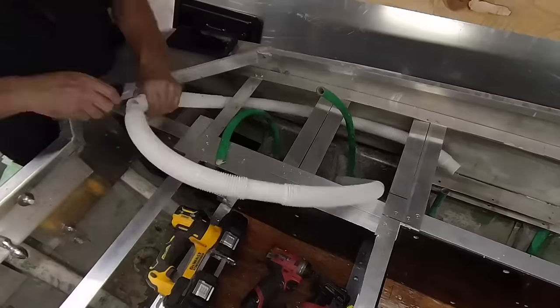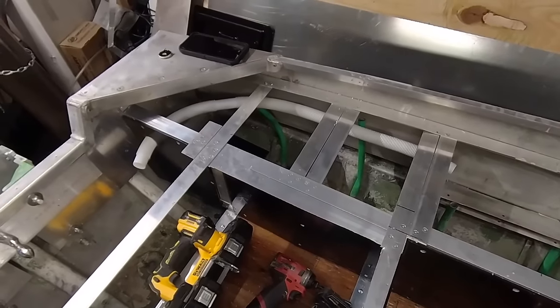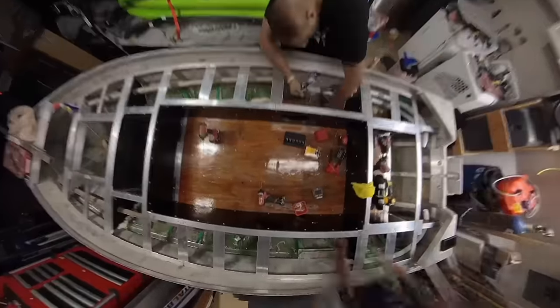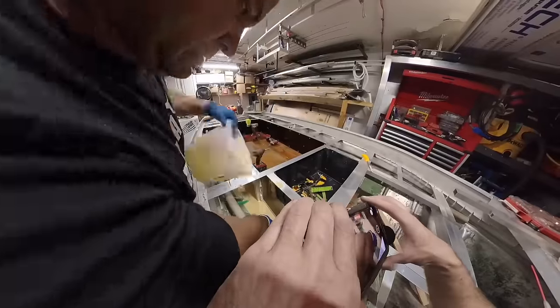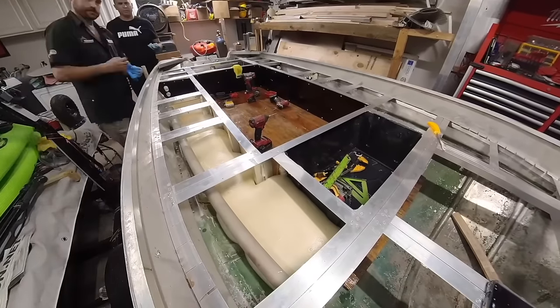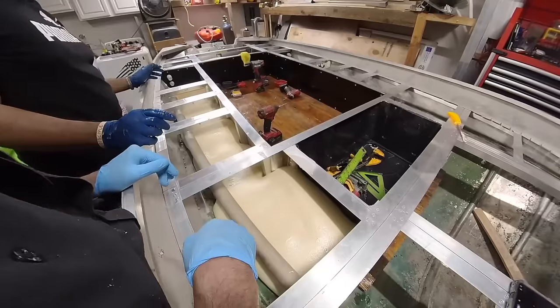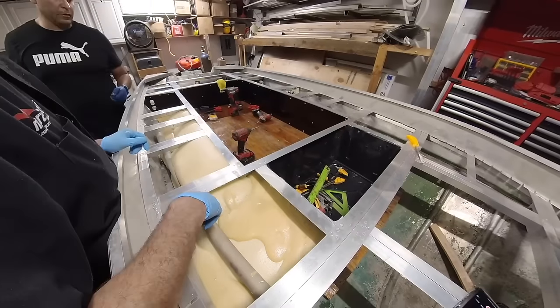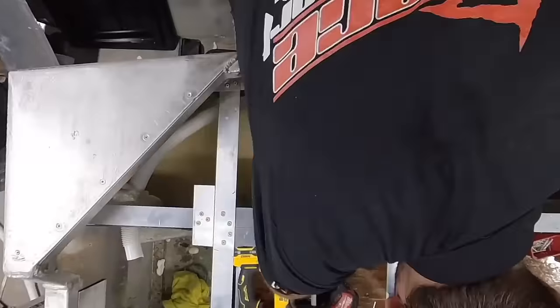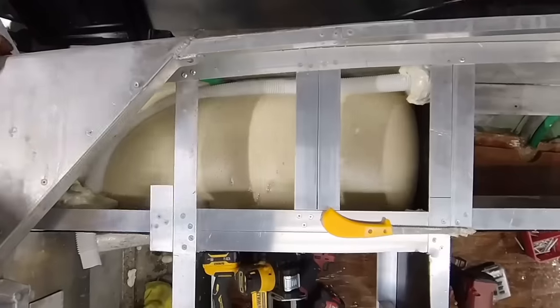Another thing that will make this boat feel solid, almost like it's a glass boat, is putting in pour foam. What pour foam does is it absolutely 100% contours to the natural shape of the boat and creates a mechanical bond. Each kit gives about 300 pounds of reserve buoyancy if expanded correctly, and there are three kits in there. It's an estimated 900 pounds of reserve buoyancy and also something that solidifies the boat. There is no other option, so I don't know what anyone wants to tell you, but really, that's the best option if you want to get results like that, a really solid feeling boat.